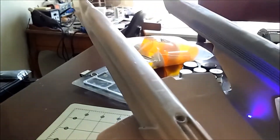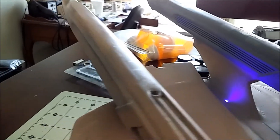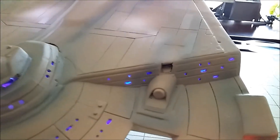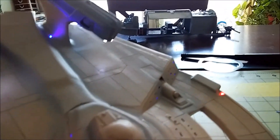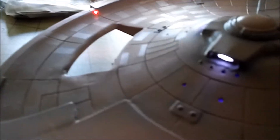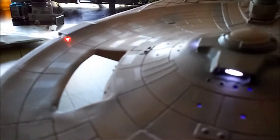It works really well on top, and in the saucer section that was far more glossy even than this one. The whole point is for it not to be too noticeable — just a subtle effect. There's a little light sanding to do on it to knock down the orange peel a little bit and smooth it out some. You can really see that orange peel on the bottom, but just some light sanding with a thousand grit or higher sandpaper will take care of that.